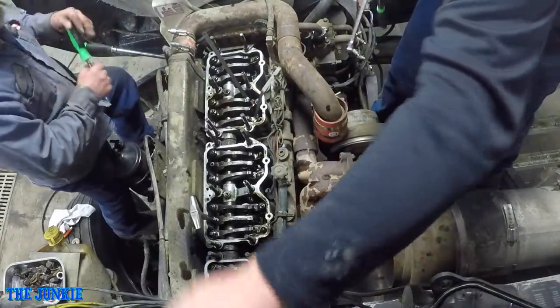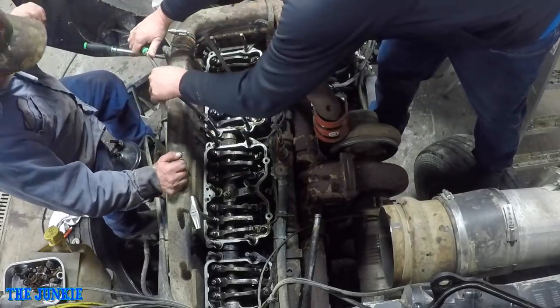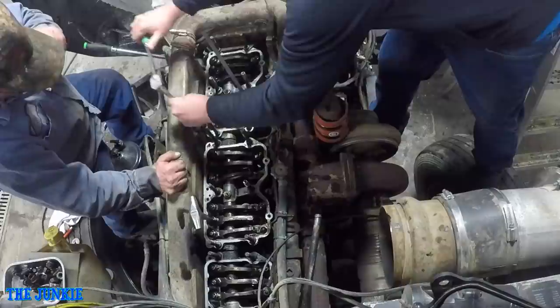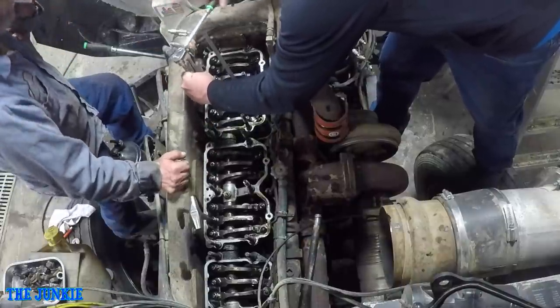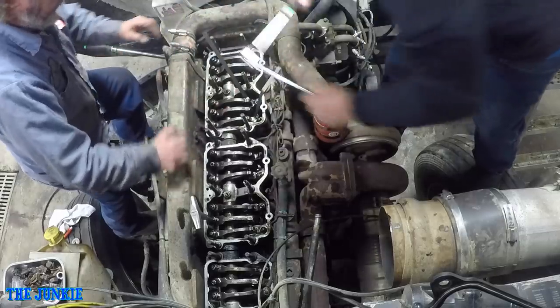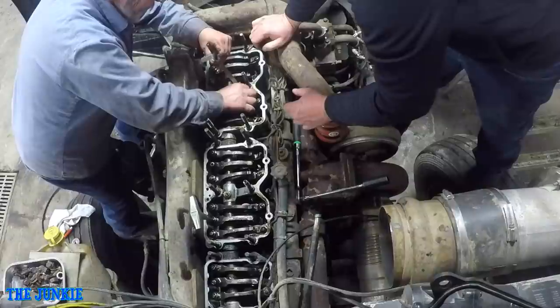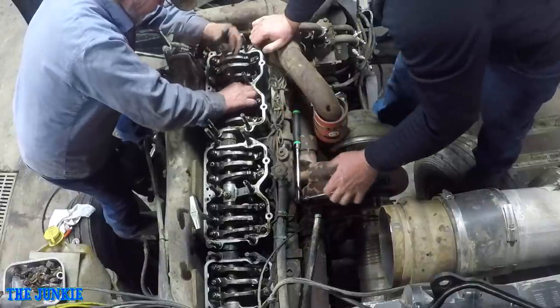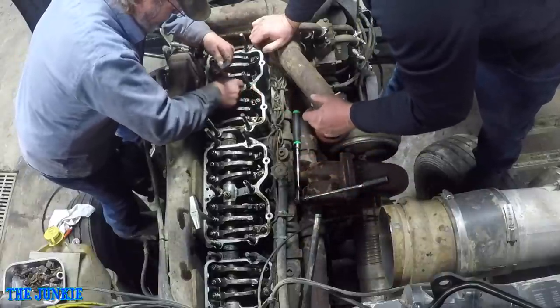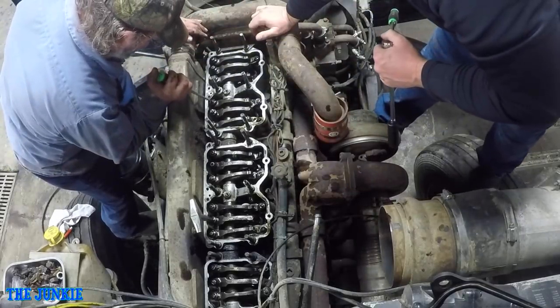You can try that - go ahead. This is old school technique right here. Because we could leave them a little loose. I'm not on there - see what you got there, Jim. That one's about perfect. The intake being a little tight, that's going to be the one that's going to loosen anyway. This is where my wrench makes it nice.